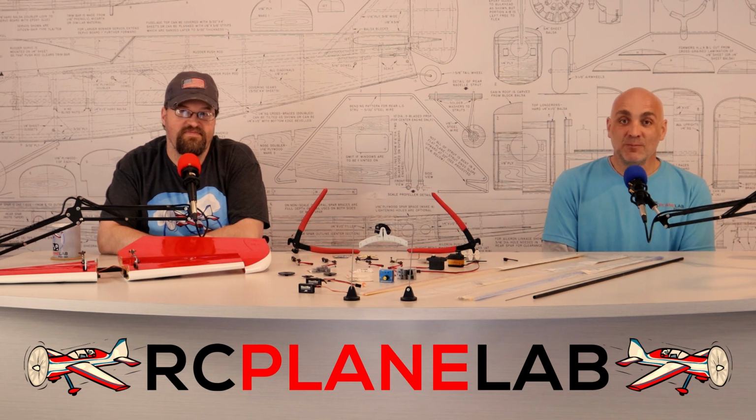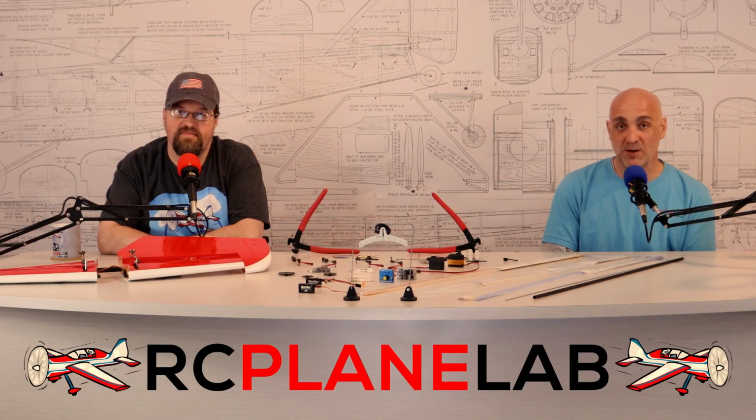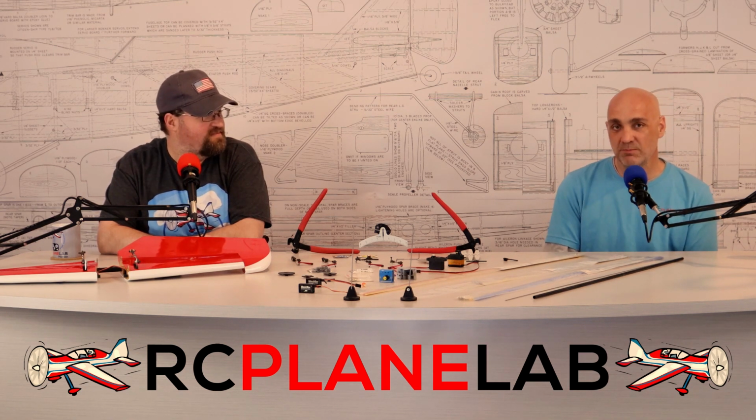Granted, but I've had them fail. And I'm not saying you haven't. I've even gone to the extra lengths that probably most folks don't, which is to grind a flat spot on the push rod where that set screw bears down, like you're supposed to do with any set screw. And I've still had them, and when I say fail, I shouldn't say fail. I mean slip. Yeah. Slip maybe.